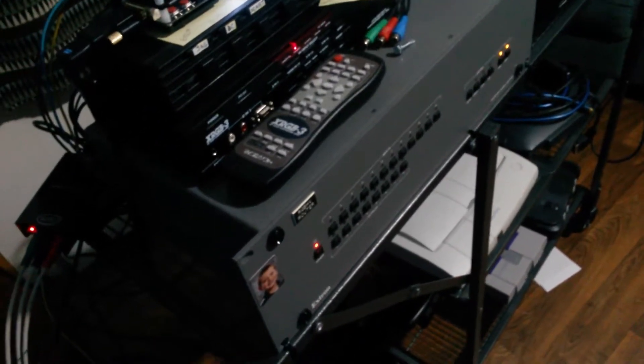What we're here for is the old cheap RGB SCART to YUV converter — the real cheap one. The SCART card does work to a degree. You can see it going to the cheap SCART converter. My question was whether the cheap RGB to component box would actually accept the 480p signal instead of the 240p it usually gets as input — and it likes it.